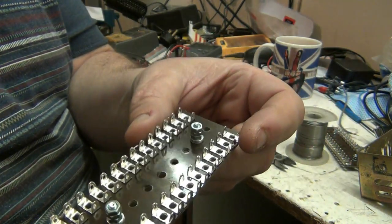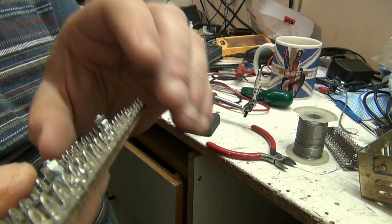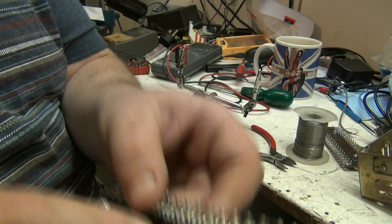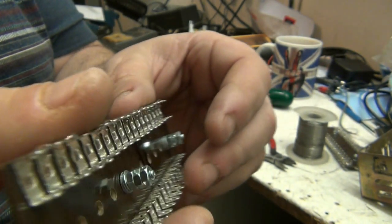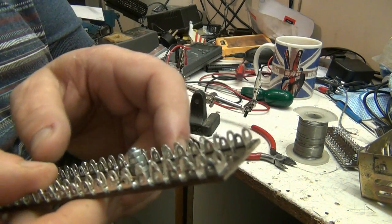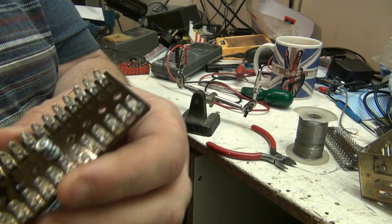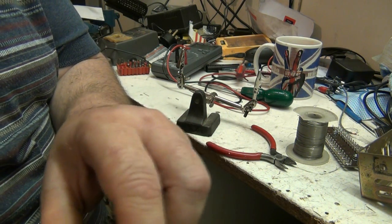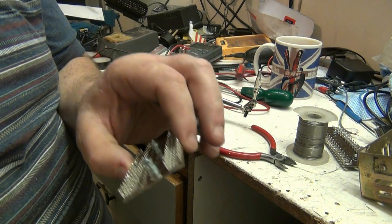Now I'm happy with that. That's all the link wires put in for one tag board. I have got the resistors to put in and we'll look at sorting that out maybe in a bit. I've got these other tag boards behind here for other things. They've got a double tag on each one. So if I had filled some of these in and can't get another component through, it's not really a great issue because I can use the other side. In the worst case scenario there's holes in the bottom as well.